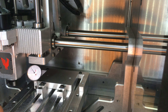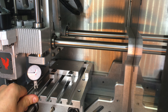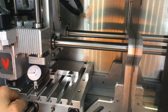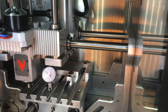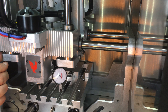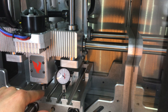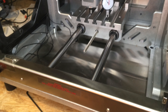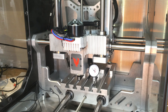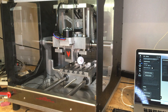Moving to check flatness — once I hit the end plate, I'm actually surprised at the flatness there. We have one thou over about three inches — that's not terrible. Their e-stop circuit works really weird; it'll be interesting to go look at it. I think they're actually using the machine to face the surface — which addresses my earlier complaint. But this machine has so much play that it doesn't even really matter. I'm going to start taking this thing apart.